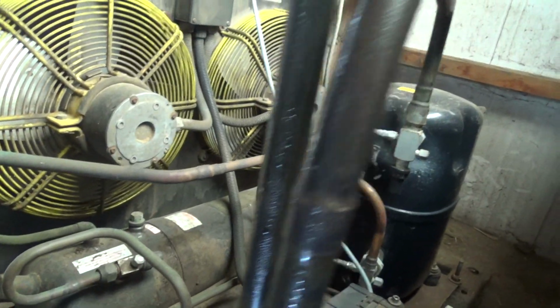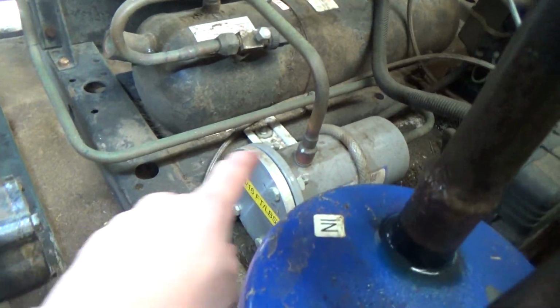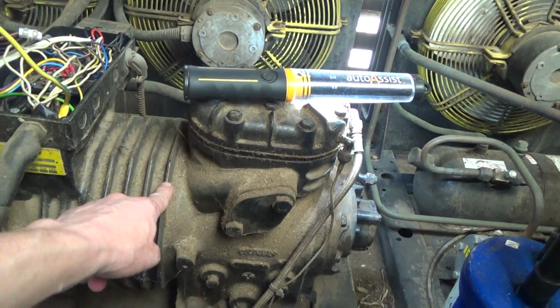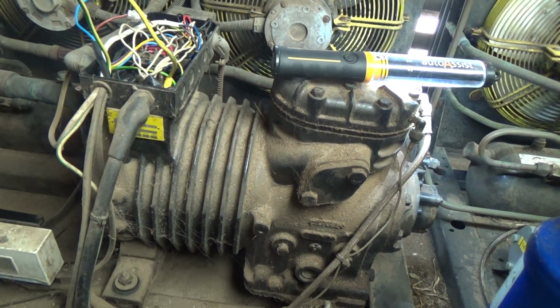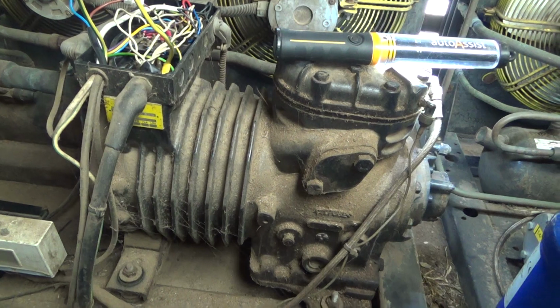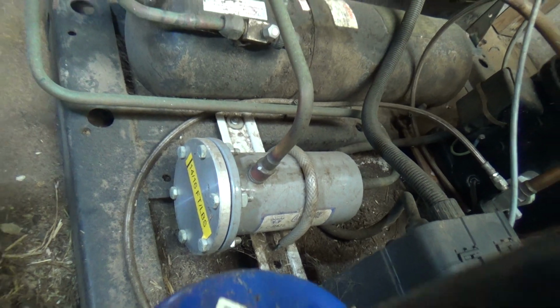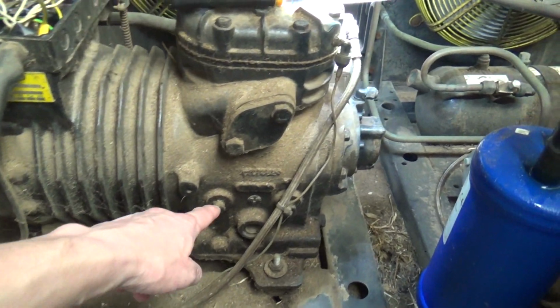Well, that's better. Last time we put a tag, it's a 4568Z I think, on there. I put a core dryer on there, replaceable core dryer filter, because I've had these when they fail. I've done them before where they chuck so much wear metal out into the system that we put a rebuilt compressor on there, and it blocked the filter up, and the thing cycled on and off on the LP, and the customer didn't notice until it killed the new compressor. So I've learnt my lesson with these. They get a big filter dryer in there to catch all the shit that comes out of these. It's going to be full of it if it's chewed up the conrods.